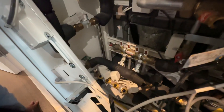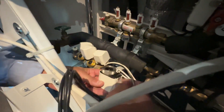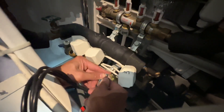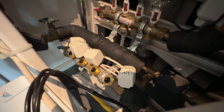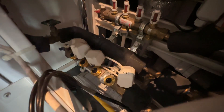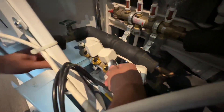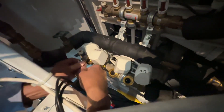Let's put them in order. These little pins here are what the thermostat activates — when it calls for heat it directs this pin to go down to open and close the flow. You've got to make sure this pin is springy and not jammed. If it's jammed, put a bit of WD-40 on it. Without the actuator on, water flows freely — so the default position if you're not sure whether these are playing up is just unscrew them all. The heat will flow; you won't be able to control it individually but the heat will flow. Let's try each one: bouncing nicely — nice and free. Third one bouncing nicely, no problem. Fourth one — good. Keep them in order.